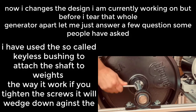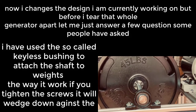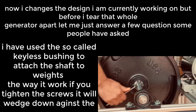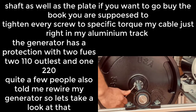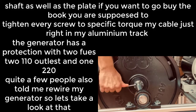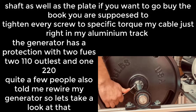Before I tear the whole generator apart, let me answer a few questions some people have asked. I used a so-called keyless bushing to attach the shaft to the weights. When you tighten the screws it wedges down against the shaft as well as the plate. If you go by the book, you're supposed to tighten every screw to a specific torque.